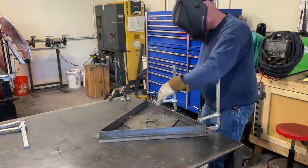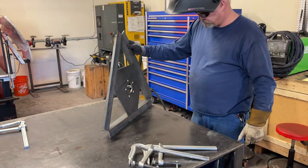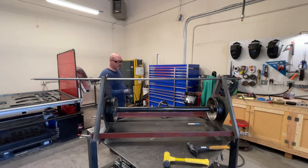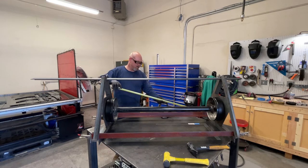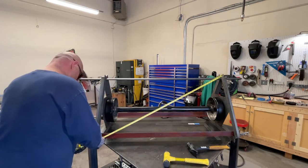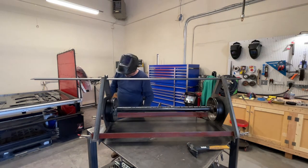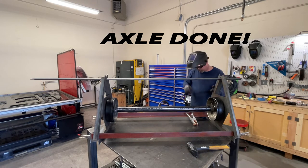Once I got these angles put together, that center was just perfect in there. Now I have this jig — I can build these axles all day long, just make them whatever length I need in between some flanges and get them bolted together. Measuring corner to corner: those dimensions are the same because each piece of angle is exactly the same length — down to probably a sixty-fourth of an inch — so it's absolutely square. Get the flanges leveled up, get the tack on it, and it's like we've got an axle. If you guys like this content, please like and subscribe and come see the next video.